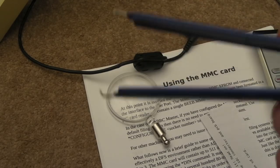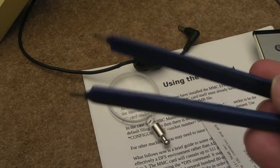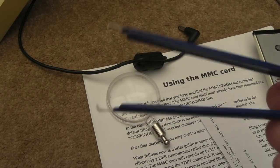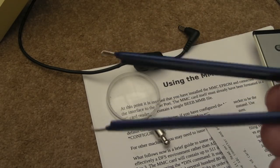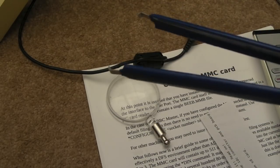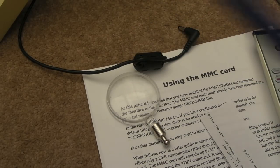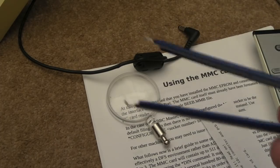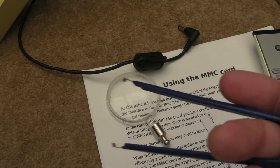So I would conclude from that some of the 6502As on eBay, Rockwells in particular, they're not As, they've been remarked. It's a 6502 designed to run around 1 MHz, and as soon as you run at 2 MHz, if you're lucky it'll work, but with the warm weather here, this is the factor, you're not only overclocking it, but you've got the additional ambient heat as well. And that's why those two Rockwells were not working in the Beeb.